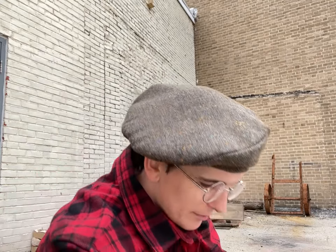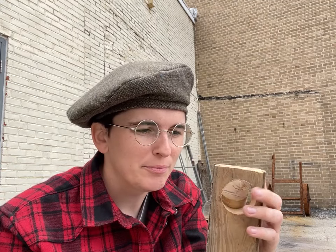But you could foreseeably get around that by, if you use metric, you could buy an imperial hole drilling set, and if you use imperial, you could get a metric hole drilling set, and then maybe there'd be a better chance that some of them would have an odder size to where maybe like a 25 millimeter hole saw would drill one for a 1-inch or whatever plug. So that could be a way around that for cheap.